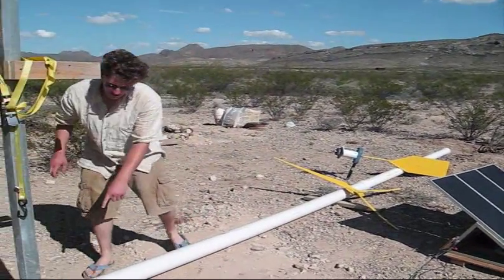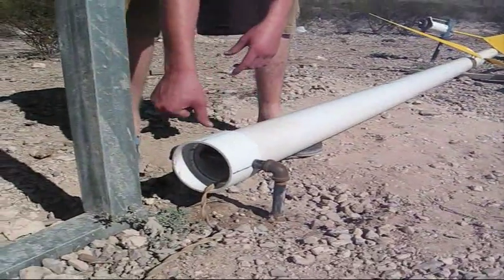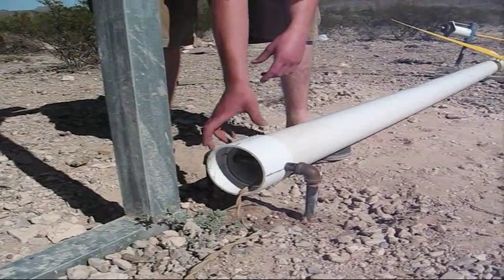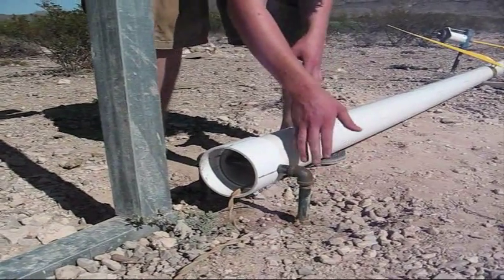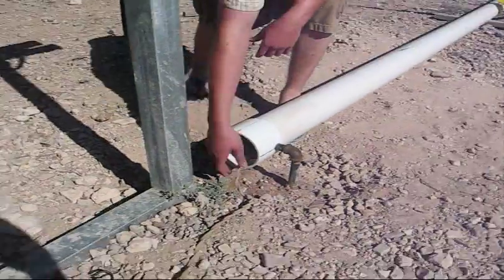At the base of the tower for a hinge, we used a coupling as a reinforcement, drilled it, and we're using this half-inch steel pipe for the hinge — it goes about 18 inches into the concrete. And then you have your hinge right here, and everything clears and the wire can go right through the tower.